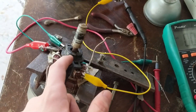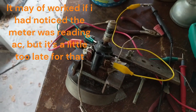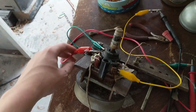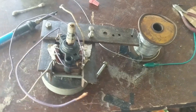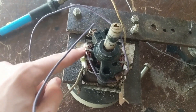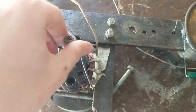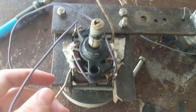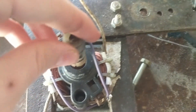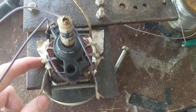Found out it doesn't work right if you power the armature and generate with the field winding — you have to power the field winding, but if you do that it generates a pretty good amount. I made some improvements: I connected both field windings in series. For what I'm doing it made more sense to hook them in series, because these pull a lot of amps at only about three volts. If you were planning to run it on one volt you might want to hook them in parallel, but I'm running off my power supply so higher volts into the field windings with less amps is ideal.